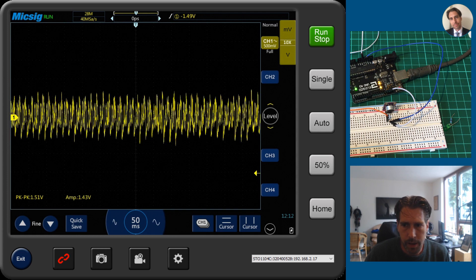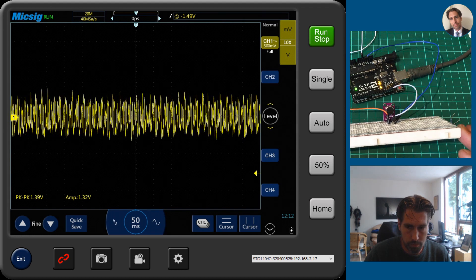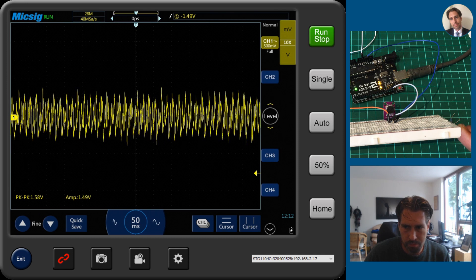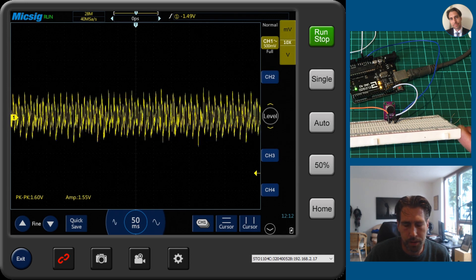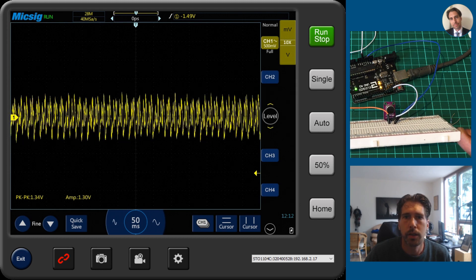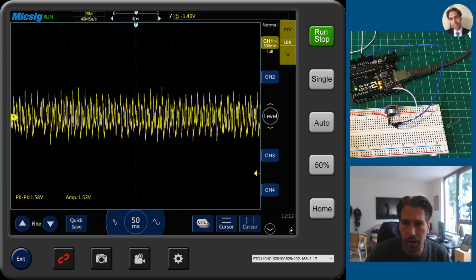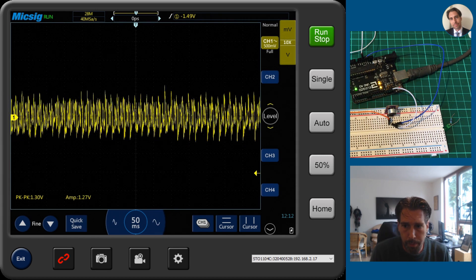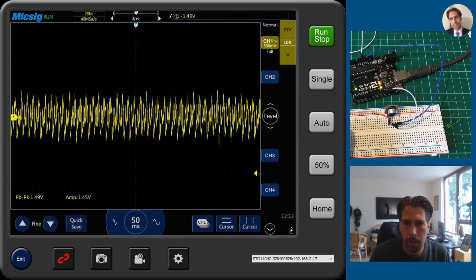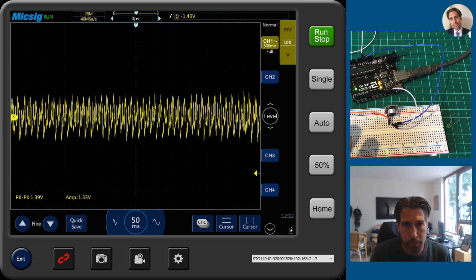This is the input of the microphone. As you can see it's very noisy and it barely detects me speaking, even pointing right at my mouth. So to use this as a microphone for audio applications, it's not going to work. What it is going to work for is using it as a sound level detector. If I clap, you can see it registering on the oscilloscope, and we could use that in Arduino to detect a level of sound.